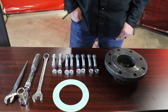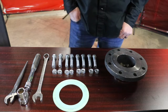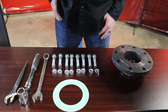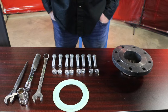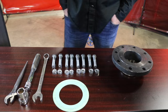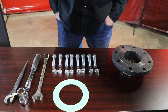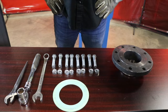The first thing we're going to want to do is examine the face of both flanges for any damage or imperfections that could cause the joint to not seal and leak. Next, we're going to verify that the gasket is the proper size, rating, and type for the application. We want to use the gasket only one time — if it's been tightened, we have to dispose of it and get a new one. Next, we're going to verify that the bolts are the proper size and length for the flange they're being applied to. After the bolt has been fully torqued, we only want to have three to four threads showing outside of the nut. Now that we've verified we have all the correct hardware, the next step is to bolt the flange up.